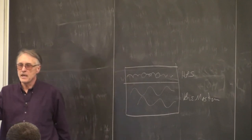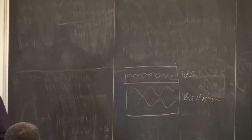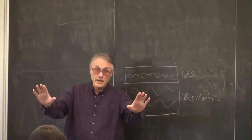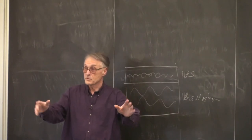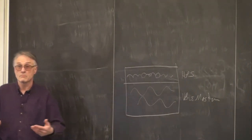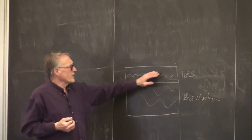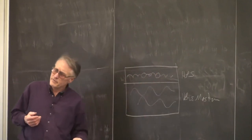Since the VGA exists on the Qsys bus, an arbitrary bus master and the HPS can both write to the screen, and the writes are synchronized by the bus. So there's no interference between them. That's pretty cool. In particular, what you're going to find is you probably won't do the animation. There's no extra credit for doing the animation, although it's kind of interesting to watch.